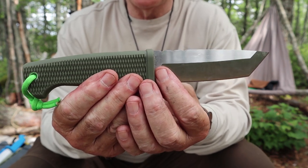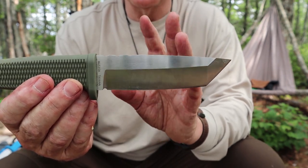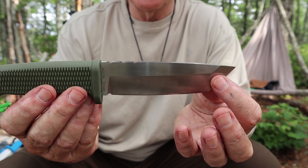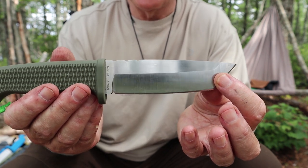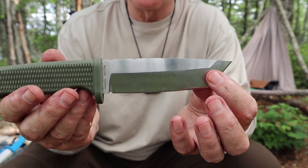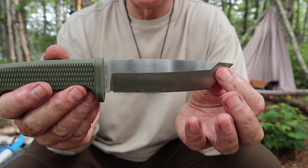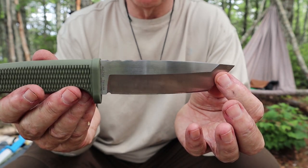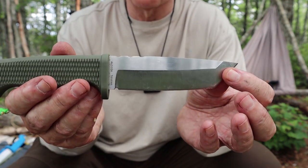The second comment had to do with rusting. Both blades are made of Japanese AUS-10A steel, which is a high carbon stainless steel of high quality. Great in terms of edge holding as well as toughness, and will take a very fine edge while still being relatively easy to sharpen. If you're not familiar with AUS-10A steel, it is an upgrade from AUS-8A steel, roughly equivalent to 440C steel but with improvements over that. It is a good quality steel and it is not prone to rusting.